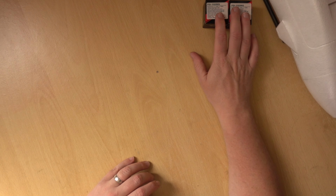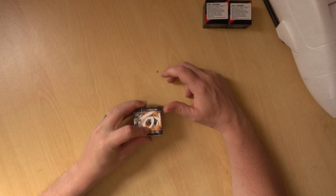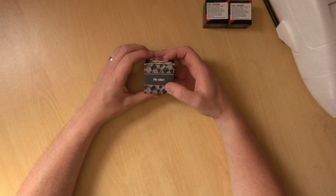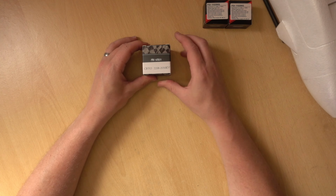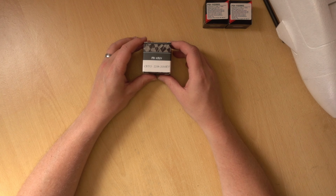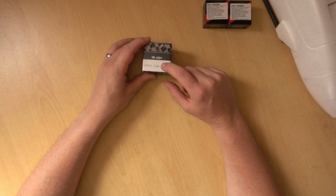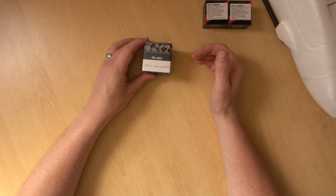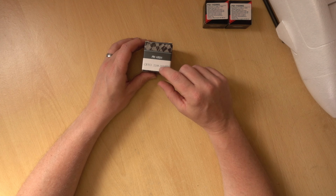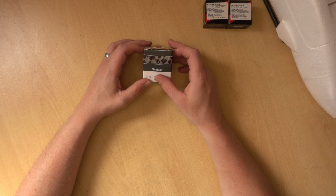So we can control our plane, but we at the moment aren't going anywhere. So what we need is a motor. So I have gone for this, which is the KO Demon Seed motor. Now this is 2208, so it's slightly bigger than the recommended size of 2306. And it is 50 kV higher than the plug and play. So it's not a lot bigger, but it should hopefully give it that little bit of a boost on launch, but will still hopefully keep the efficiency for the flight time. That's what I'm hoping for anyway.